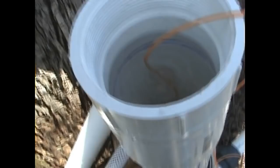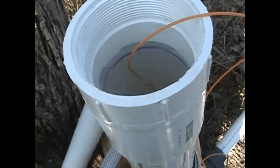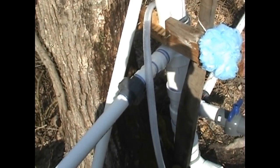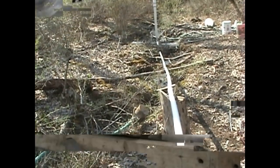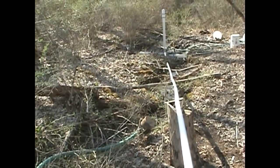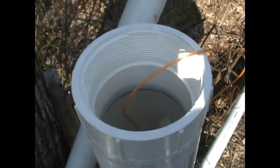Notice the sound is a little different. I'll take the glass jar off here. It's all clay down here, a little slippery. That's a real solid thud — much better than what we were getting before. I suspect some of the issues I was having with that inch-and-a-half swing check actually had to do with that spring check valve going bad. I wanted you to hear the stand pipe so you could hear the difference. Now we'll go up and do the real test and see what the volume delivery is up there.